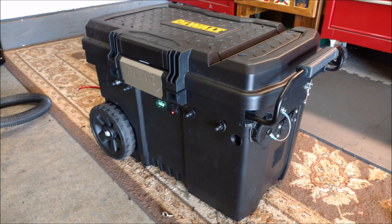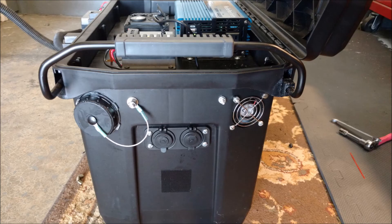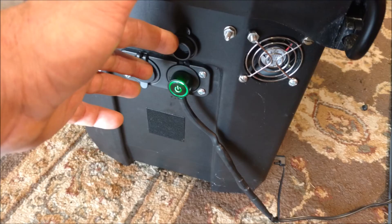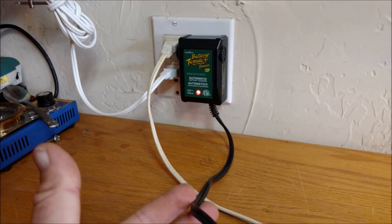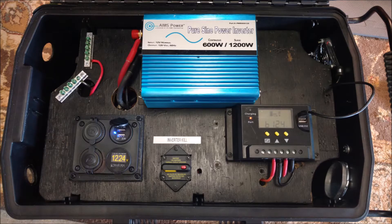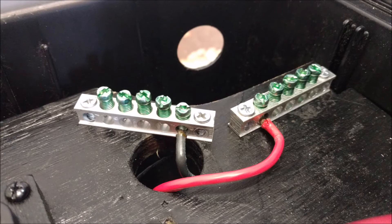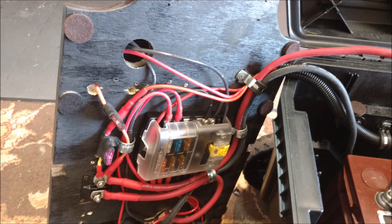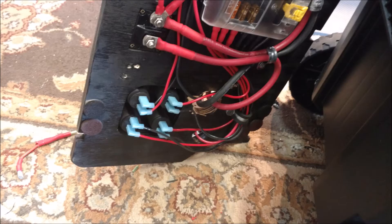Now I'm going to show you some stills of this project. Here's the 12-volt socket. Battery Tender Junior. Here's a good picture of it with the guts hanging out - I did some cable relief in there too. There's a close-up of the Eaton ground buses, now functioning as power buses. Solar charger there - there's a Hompi 30-amp PWM. Here's a picture of the fuse box and some of the spaghetti wire underneath. I had to use separate fuses on a couple of things.